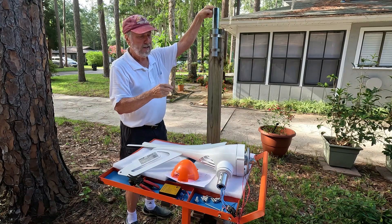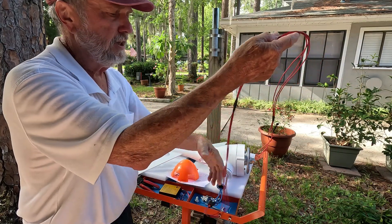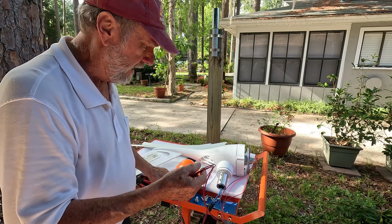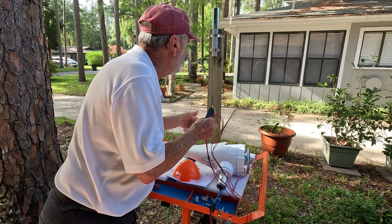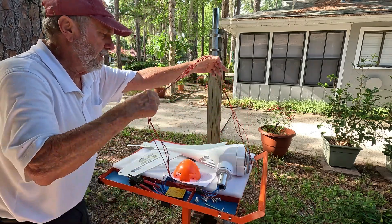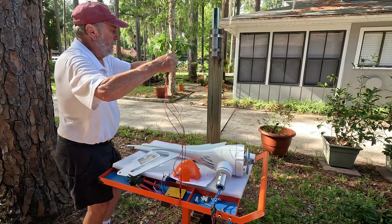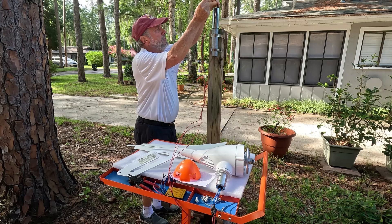Now I can put in the wind turbine, with little pieces of tape here to secure the wire. This may be 18 feet or 20 feet — whatever length of your pole and the distance to your controller — so all of this has to be planned out ahead of time. I'm going to run these down through here. Make sure the sleeve is in position.